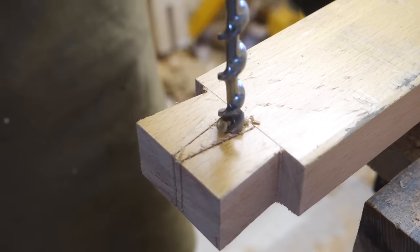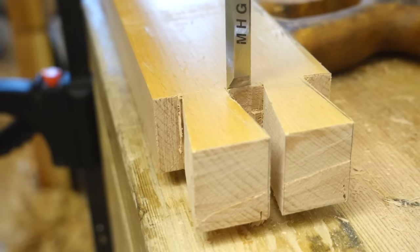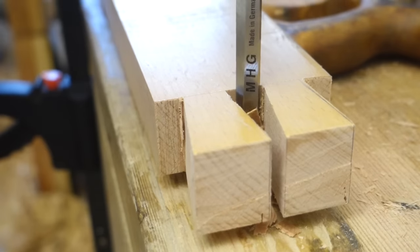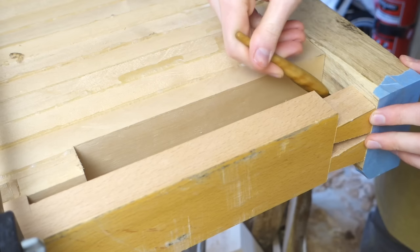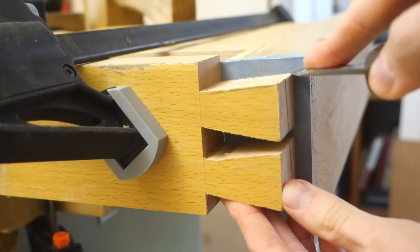Another way would be to put it on a low saw bench and use a tenon saw or panel saw that way. Then I knifed the baseline and dovetail shapes onto the pinboard, which is the oak end cap.